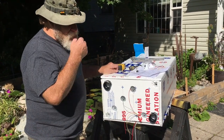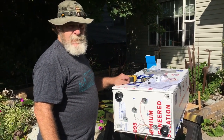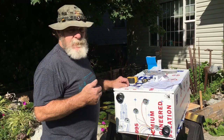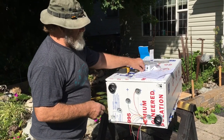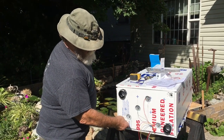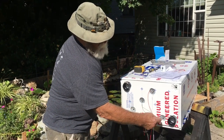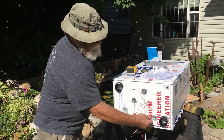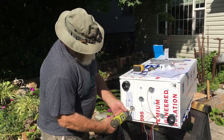This is our holding tank for our gray water because we're having a cassette toilet, so we're not going to have actual black water. And this is set up pretty much the same way as our fresh water. I just wanted to show you this because you get these little probes and you line these up. So this would be low, medium, high, and then a common would send a signal. If it's at the low, it'll send a signal between these two, and then it goes back on this to the receiver in there. But it's just a 3/8 hole.